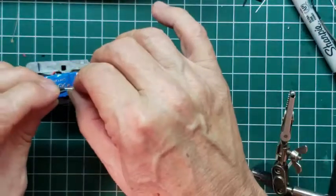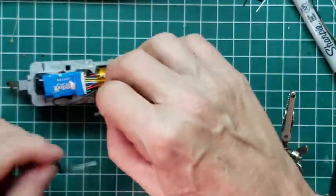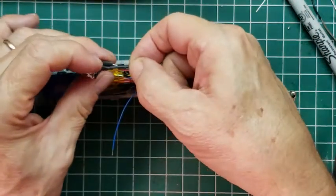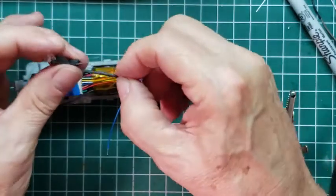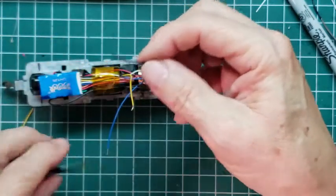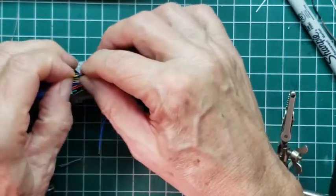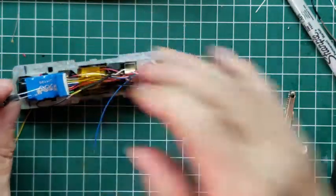Okay, now then the other two pieces I'm going to be soldering to, right? I'm going to solder them fairly far back, so I'm going to need to put the shrink tube on there ahead of time. Right, so this piece, you know, I'm doing this out of camera, so you can't see it. This piece, it's going to go inside of this, right? So, shoot, what I got there is probably right. But now the question is, can I get it all on there? Oh yeah, that'll work. Get it all on there before I solder it. Yep. This is going to work, he said.